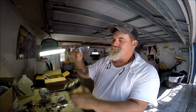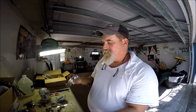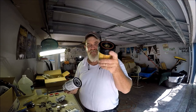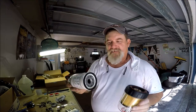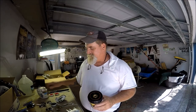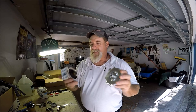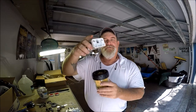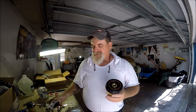Here's the head unit that would be bolted up. Raycors have always been known as having a little hole and a big hole - I've always used the big hole. If you have a big hole head unit, from what I understand - because it doesn't say it anywhere - you can't take this MARPAC filter and put it onto your old Raycor head unit. If you see this for sale all over eBay and at marine dealers, they're just selling this filter alone, and you've got to look for people selling the entire thing.